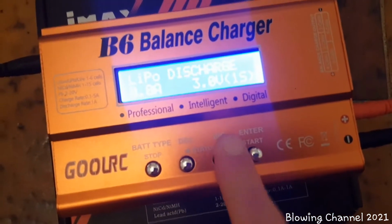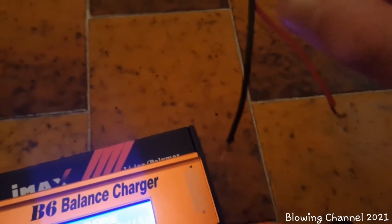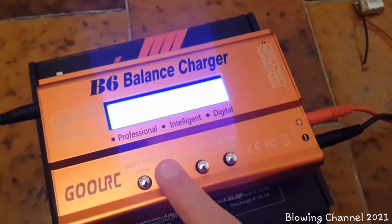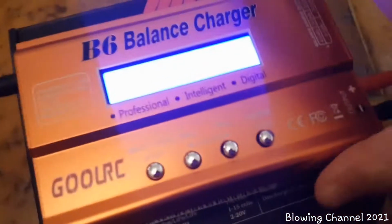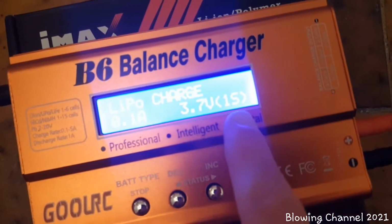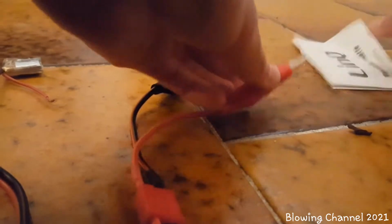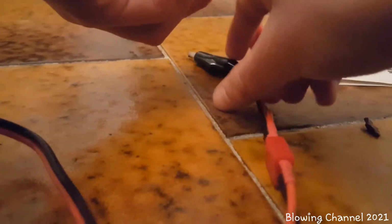So let me quickly show you a LiPo charge. I want to charge this tiny 1S battery, which is under 50 milliamp hours. With under 50 milliamp hours, it's a better idea to use really low current for such a tiny battery. For example, set LiPo, 0.1 amps, 3.7 volts, 1S. So now I can connect it with those crocodile clips that it came with. And in the next video I'll also show you the multiple adapters that this came with.